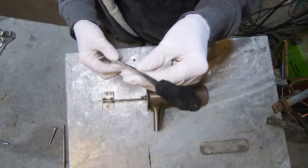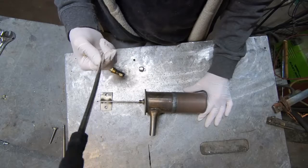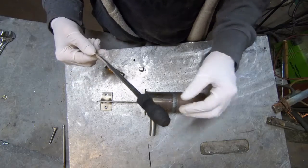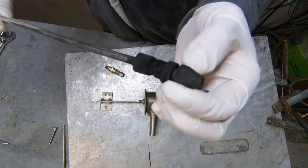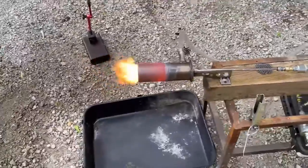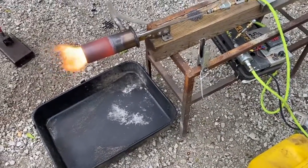My opinion regarding these types of burners is they're just inferior to the compressed air systems because of these nozzles. These types of burners work okay for one particular setting and then that's it. Like if we wanted to design a 60,000 watt burner, we would make a nozzle that atomized at a flow rate congruent with 60,000 watts. I was able to pull some tricks out of my hat and get this particular combustion chamber to work at different settings, but the combustion is less than favorable.